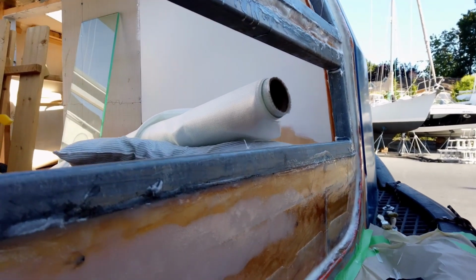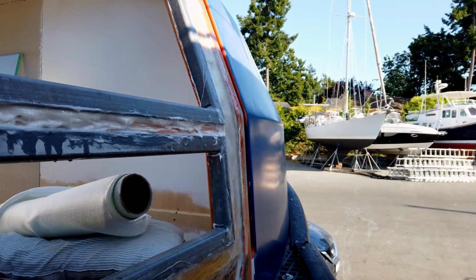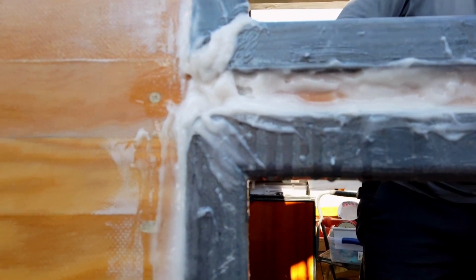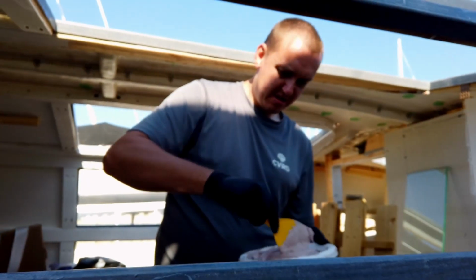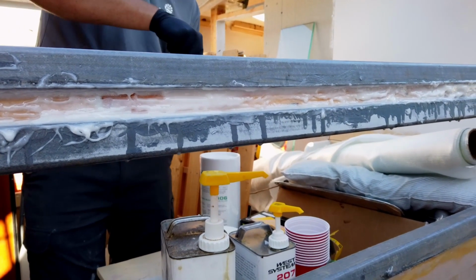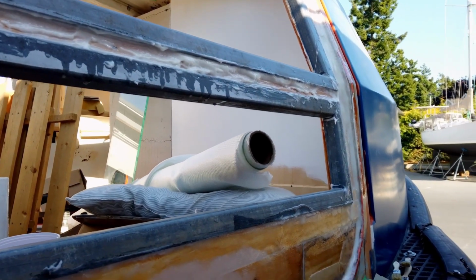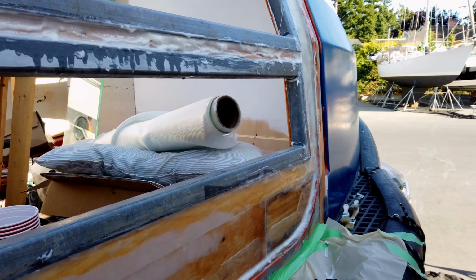I went to go get lunch, and like Toryn said, he was able to put some fiberglass down over top of that kind of damp, thickened epoxy, except in this middle spot, which is so small that we just fill it all with fairing compound, right? Yeah. So, after the initial thickened epoxy that's in there, and just a few epoxy layers, now we're just putting the fairing compound in. Yes, so Toryn's mixing that up, and then I will smush it in there, and slowly we're smoothing out this boat.